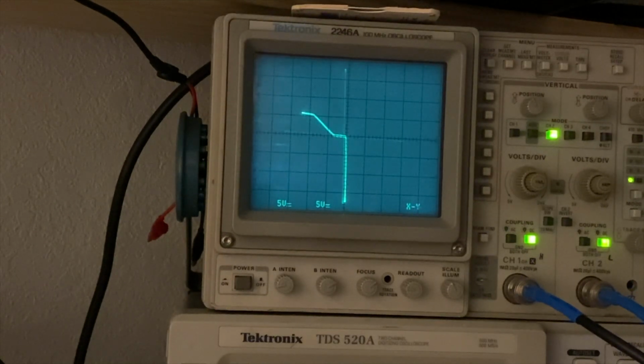Pin 7. I didn't think we'd see problems with this IC, but very interesting. There's pin 7. You can see there's an obvious short there. Pin 8. Wow, so let's go back to 7. So I'll tell you, this is reference test, good, bad, good, bad. Pin 8, this is good, bad, reference test, reference shorted.